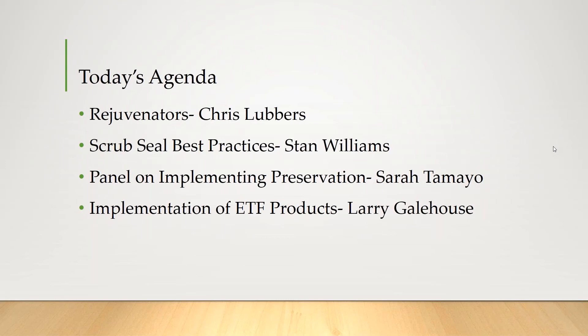What is the square yard cost of a scrub seal versus a chip seal? That's really hard to answer across a region this big. Scrub seal emulsions generally do cost a little bit more because you've got different components than a normal chip seal emulsion. Contractors tend to charge a little bit more too because they are having to use a broom in the process. In my area, I'm not a salesperson, I'm a technical person, but generally it's about 25 cents or so more per square yard — though that'll be different in everybody's area.